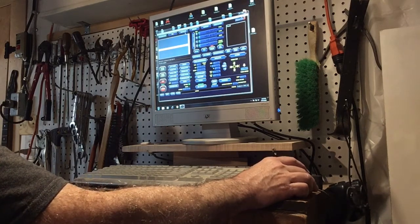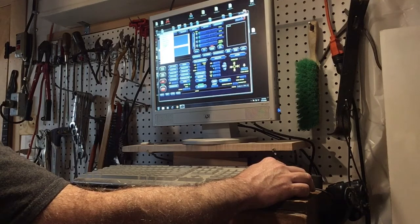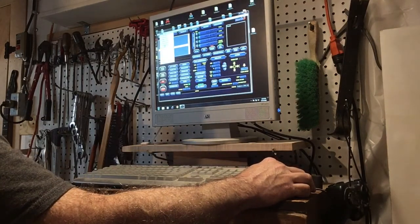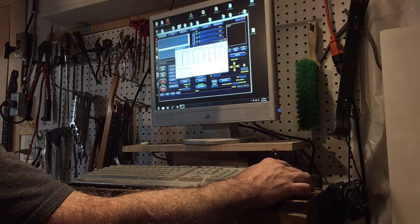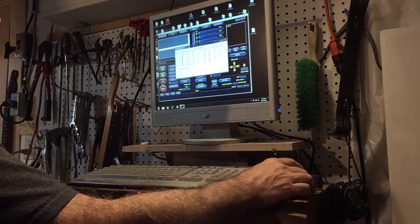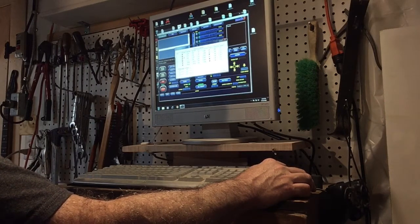All right. Now, in order to set the Y soft limit, you will go up into Config, Homing and Limits. Okay, let me do that again. Go up here, click on Config, go down to Homing Limits and click on that. And then you'll see your six axes. You will choose the Y. That is the axis that I call Y from front to back. And it is not reversed. In other words, it's going from 0 to maximum inches, positive.